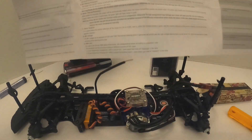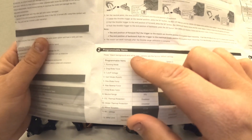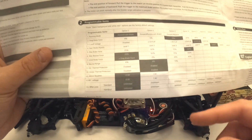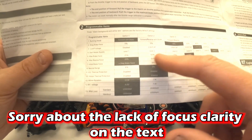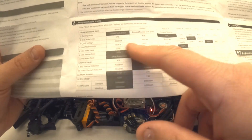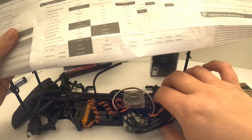So the initial setup has been completed. If you look at your user manual for the HobbyWing, the black background with white text options are the factory default settings - which is what we currently have. We have forward with brake, 25 drag brake force, BEC voltage set, neutral range set, maximum brake force at 100, and then options like your LiPo cutoffs. Our start mode punch is at level seven. So these are our default settings.